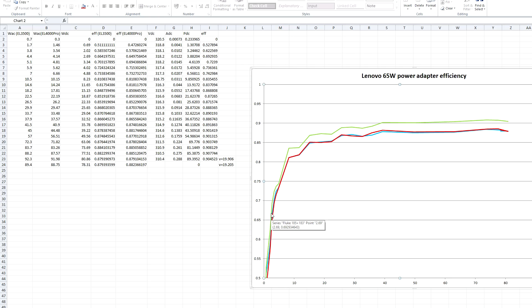What we can see is that the power supply, looking at the red and blue lines, achieves about 87% efficiency over most of its useful load range — between 30 and 80 watts. This power supply has overcurrent protection and we know it's a 65-watt power supply, so you'd expect this to be roughly the maximum power it can deliver. But it actually delivered 83 watts until the voltage started sagging big time — that's a very high margin.